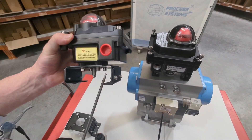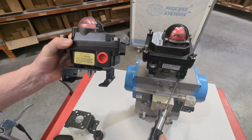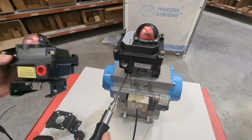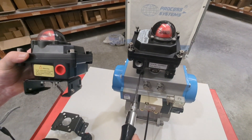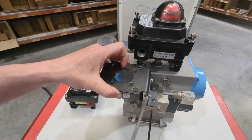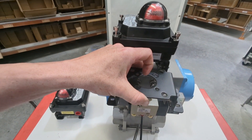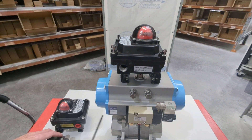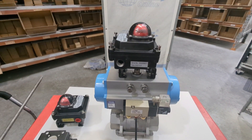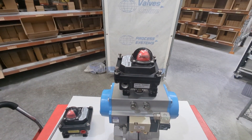The good thing about this bracket compared to most is that it's a multi-size bracket. On the top of the actuator where we've got this mounted, this looks like an 88mm spring return actuator. If you went up to say a 150mm actuator you'd find it's another size, so the legs come out and the spacing goes higher. This bracket can fit two standard sizes — what we'd call small and large — and while there are other ones in the series, this covers most of them. So it's handy if you're not quite sure what the mounting is on the actuator, as this bracket will most likely cover it.